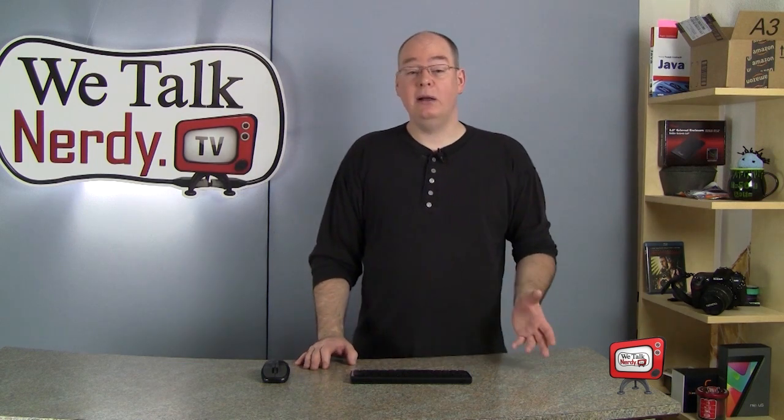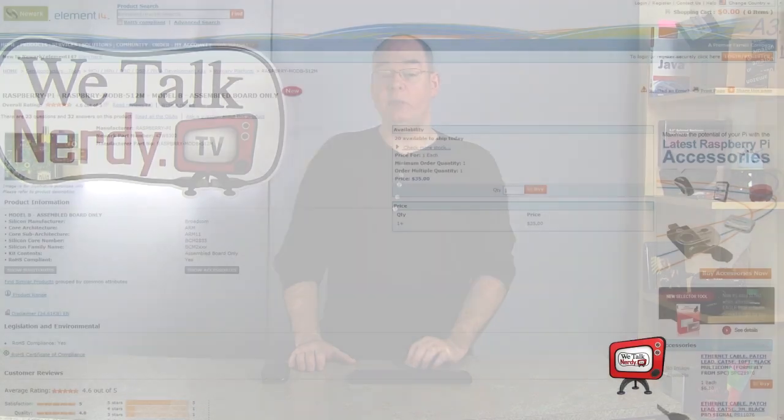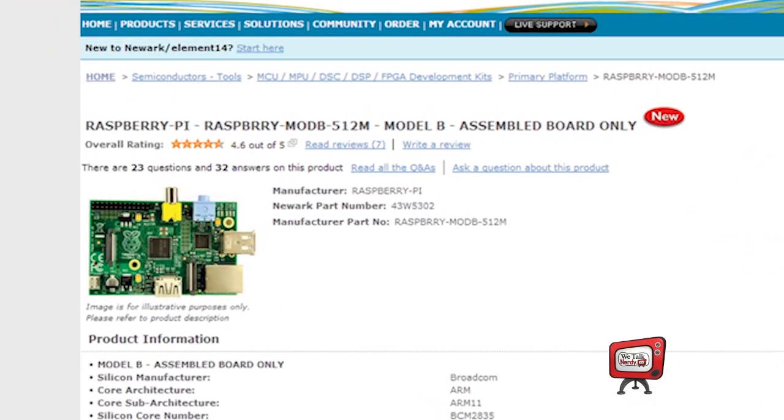I'm going to show you some more resources to expand the capabilities of your Pi. But first, if you're looking to get a Raspberry Pi, I have to warn you — you might have a little trouble finding one. Apparently there was a recent shipment, especially the $25 Model A, and it sold out right away. There seem to be a few of the $35 Model Bs available. I would suggest the Model B over the Model A anyway, since it has twice the memory and two USB ports instead of one. When I checked www.newark.com, one of the official US resellers, they had 20 units in stock. You can also get a Pi from unofficial resellers on Amazon, but they might be as expensive as $45.